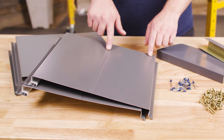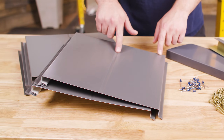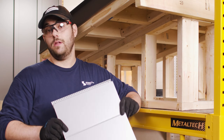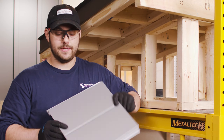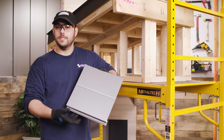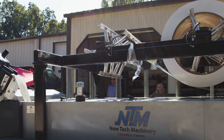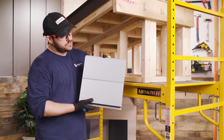What I've got here is a 1-inch flush wall panel. This is 24-gauge steel with a PVDF finish. This is a 50 to 60-plus year product that we're going to be installing today. One of the benefits of this profile is the variety of looks that you can get, especially if you're a contractor running it in your own roll former, because you have full control.